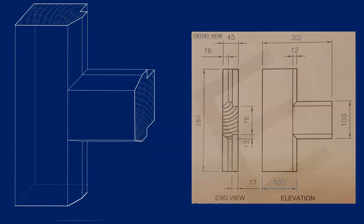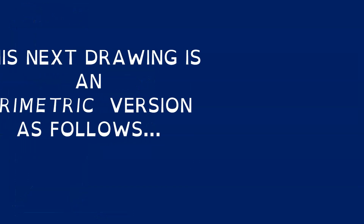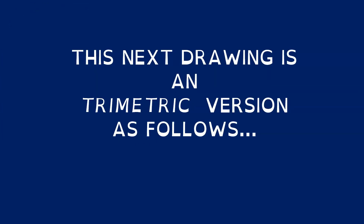When printing the title of that view, make sure you're touching those guidelines with your lettering, as illustrated. That completes your oblique view. Put in the dimensions as shown — show your extension lines off the object, keep the arrow tips as small as possible for a neater look, and make sure those tips touch the extension lines. The height of the text on the dimension line is about half the title height, so about 2.5 to 3mm high.